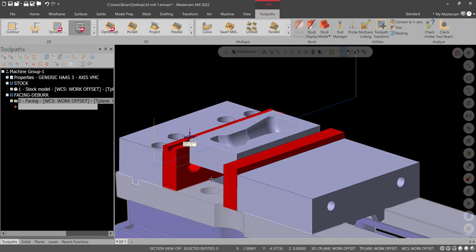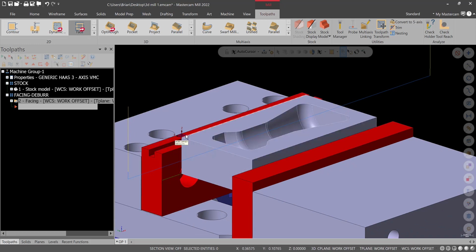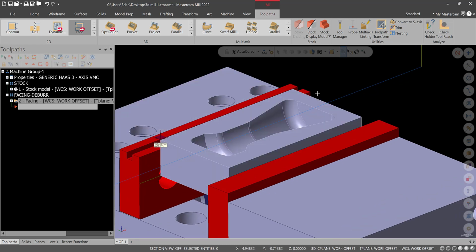All right. So now let's take care of deburring the outside of the workpiece quickly. All right. Now we may or may not have done this already, but we'll face it. And the reason I'm not worried about creating the other sides or anything, because again, what we use for stock changes. So we could be using 4-inch stock, who knows? So we'll just focus on what's different and new, and then you can create a program at this point that can take care of the rest of the operations, or you can present me a process plan for taking care of the other ops. Like maybe if this is 1.5-inch stock, grab it by the 1/2 inch, machine around, deburr, flip it, then face off the 1/2 inch. That could work. Just let me know. This is focusing on mostly just this face and the 3D milling portion.